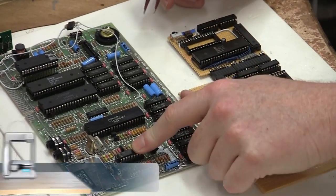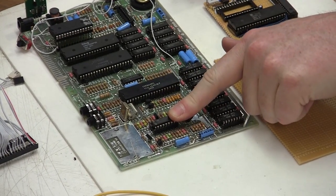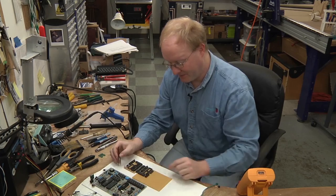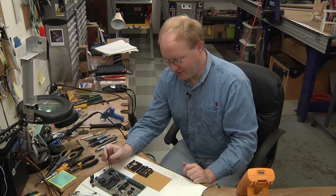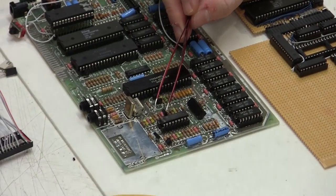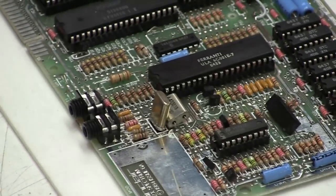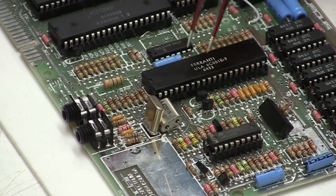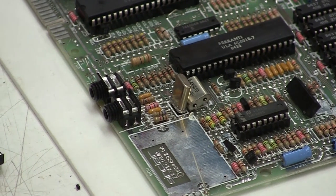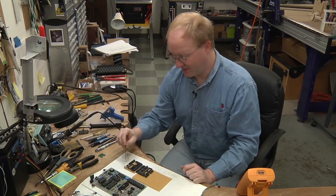This is the TV signal chip — it sends YUV to this chip, which uses circuitry to convert it to a PAL signal. The brick wall we've run into is these high-speed switching transistors. This one takes the clock from the ULA and divides it in half to send to the Z80 — there's a 14 MHz crystal going in, divided by two, then divided by two again to give a 3.5 MHz clock speed for the Z80. We don't have transistors that are fast enough here, so we're going to have to order some. That'll have to be in the next part.